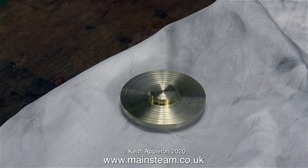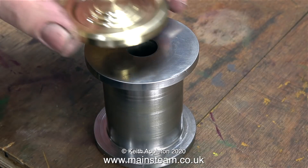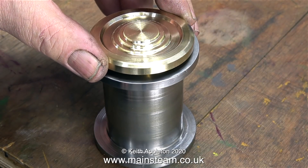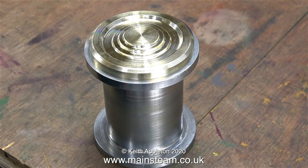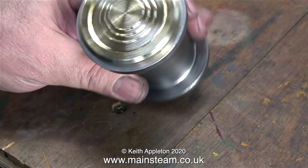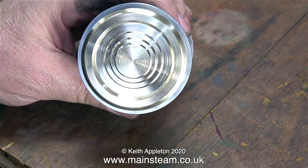I'm not going to show the turning process because it's a really simple one, completely freehand — make it up as you go along. This is the back of the part that I made, and the spigot on it fits into the hole in the pulley, which is three quarters of an inch in diameter. The spigot is just a firm fit in the hole, not tight at all, but not slack either. The turning was extremely simple, I just used a round nose lathe tool, and I think it came out okay.